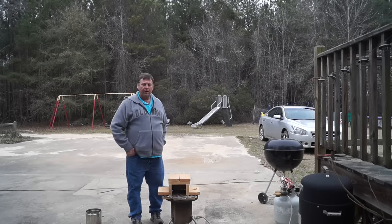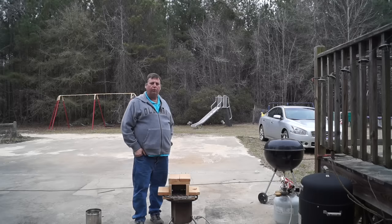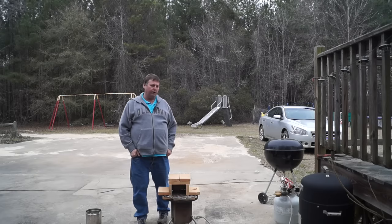What we're gonna do is light it off and let it warm up for a minute, and then we're gonna put the angles in it and heat them up to their cherry red, and like I said, quench them in oil. So if you stand by, I'll light it up.